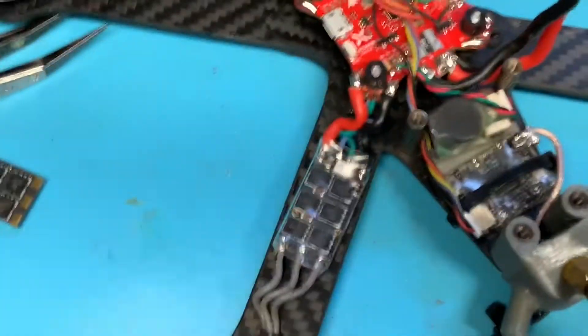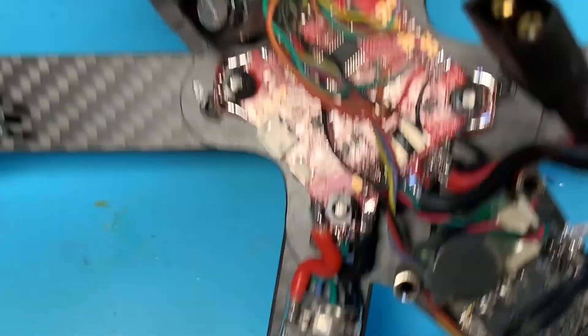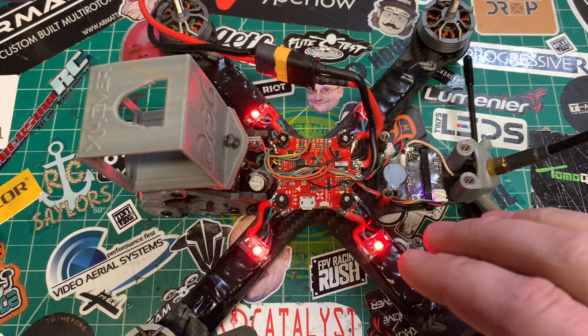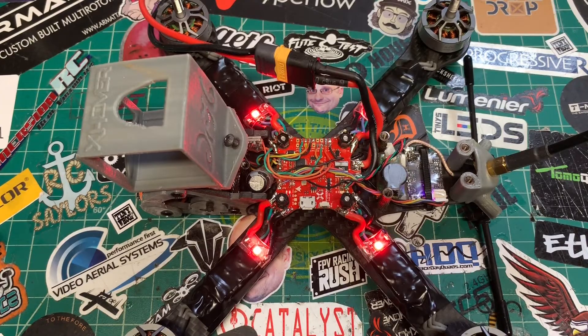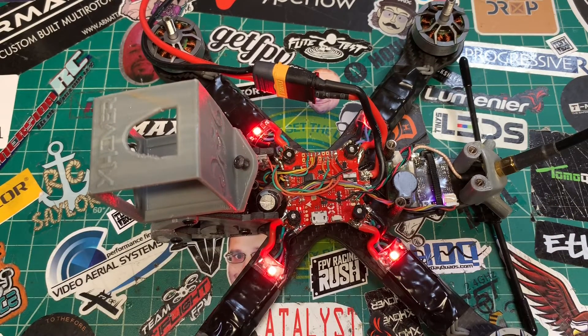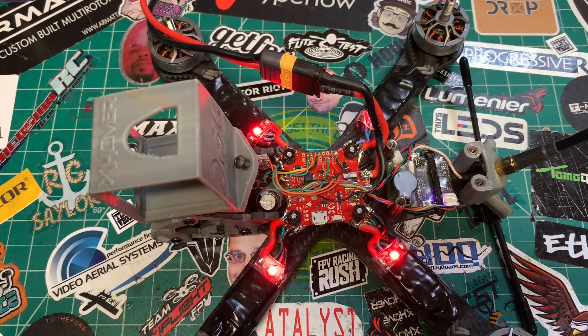We can tuck that down, and there we go — that is one ESC fully installed with telemetry and everything. I'll get all four of these done. That is how we install these RDQ ESCs onto a frame. We got them finished up, went into the software, and confirmed the LEDs are working. Everything is taped up and we are spinning. If you want to see how to use the BL-Heli 32 app on Android and how to get telemetry actually working, I split that into another video — the card should be at the end. Thanks for watching, keep burning some packs!